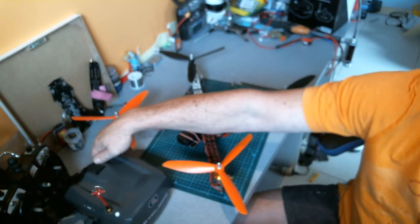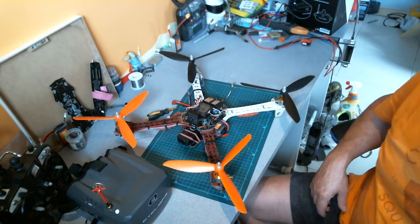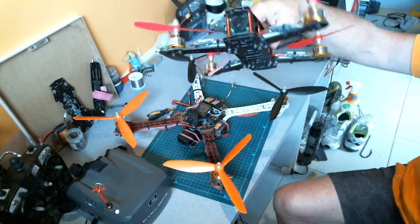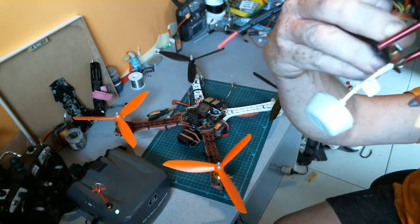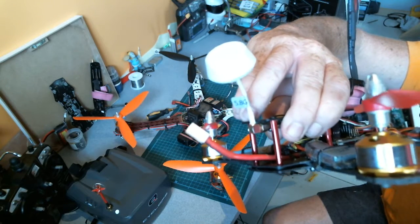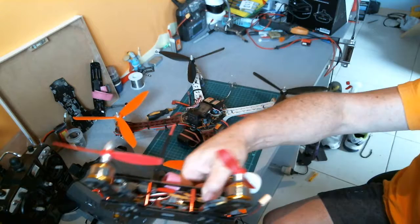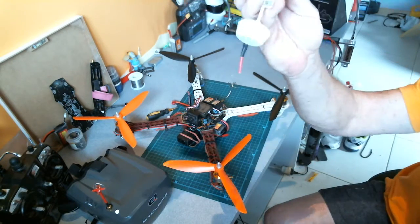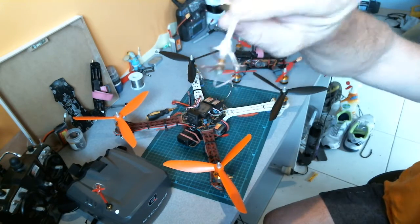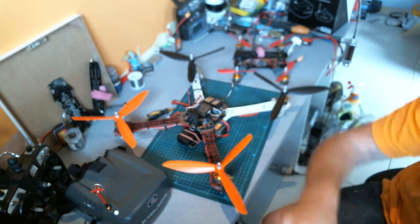I was flying around a small local cricket field with my 250, which has one of these plastic mushroom antennas. Now unless this is a right-hand polarized, I've been managing to receive it fine all the time off my left-hand polarized old goggles. Or this is left-hand polarized like the other cheap one I cut apart that was on my other 250 — same looking one — and it's left-hand, not right-hand like the one on my Cyclops.